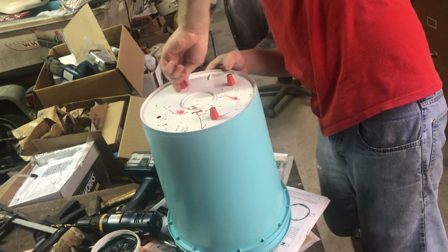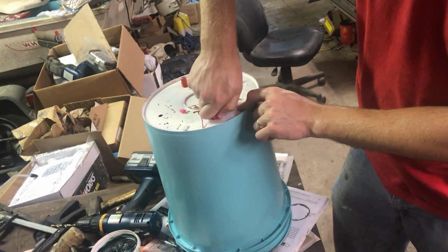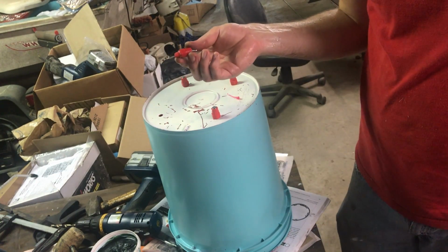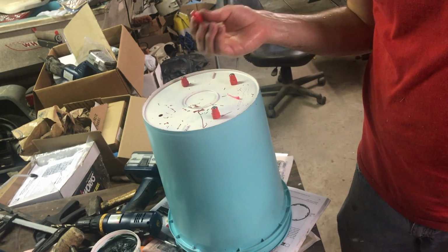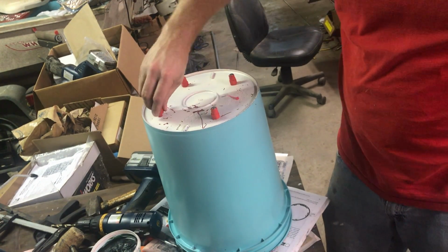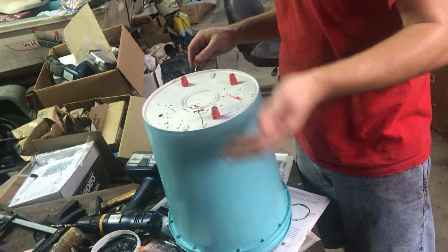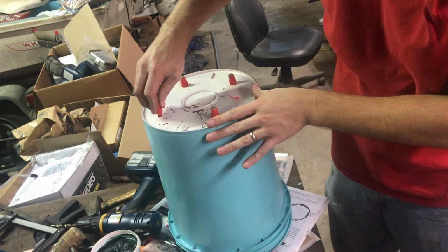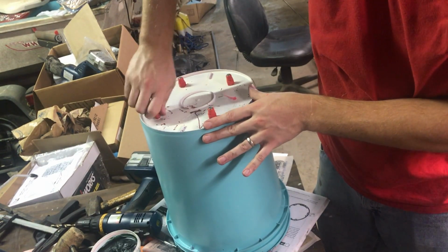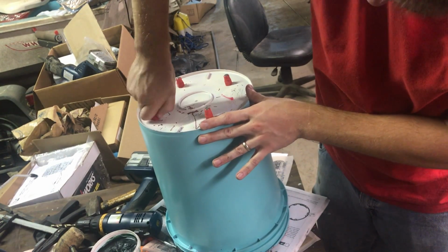One thing I was going to mention: these things will not seal up to water pressure. That's why in the other coop, even though I've got it hooked up to water, it's still gravity fed. You can't just plumb these into a piece of PVC and hook it to a water hose or a water source, because they will not seal, they will leak. They will only seal with a non-pressurized, gravity feed water system. I even tried using a pressure regulator on them, and they still leaked.